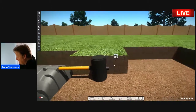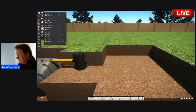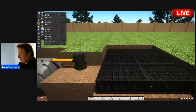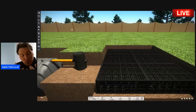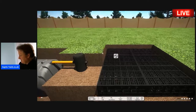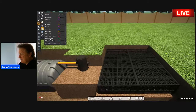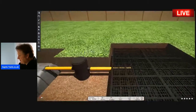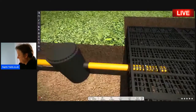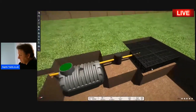What we do now — and this is what many of us do — is put septic tank soakaway crates into the hole. Just to be clear, these are not rainwater crates. Many people get confused between rainwater crates and septic tank soakaway crates. You can't use rainwater crates because the membranes are different, but you can use septic tank soakaway crates. Then all you need to do is put a connecting pipe from the inspection chamber to the crates — you cut a little hole into the crate, cut a little hole through the pipe, and just insert it about a foot, half a foot. As long as it goes in there, that's fine.